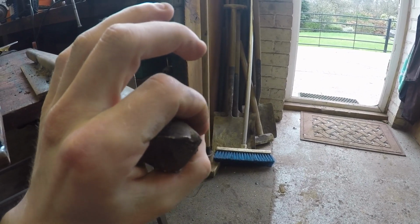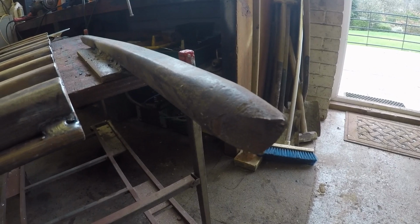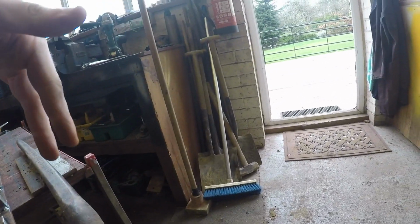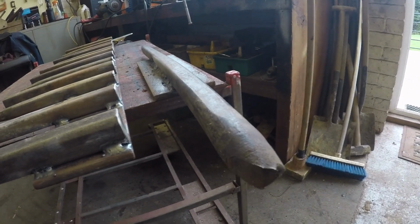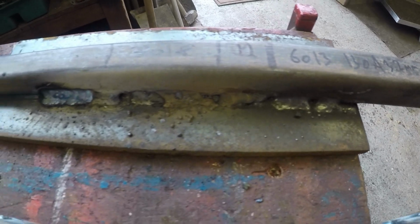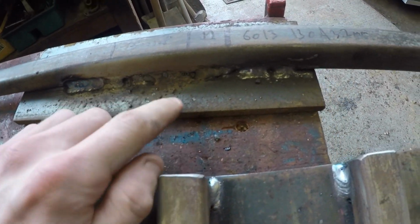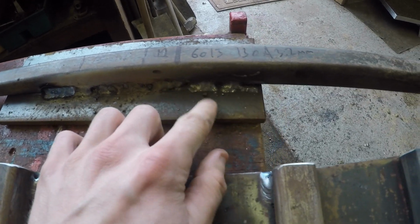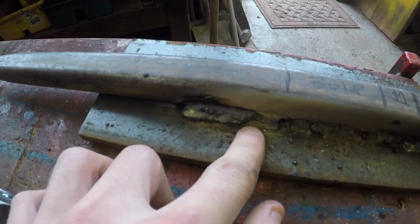Sort of the circle, it kind of works loose, and then you get them, if you catch something or you use a fork sort of vertical and rake, it just snaps them. But yeah, so like I was saying, they're a funny steel, so I tried a couple of different rods. I tried 70-18, which are a bit fancier, but didn't do very well. Some 60-11. Found 60-13 works best.